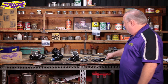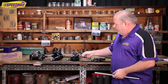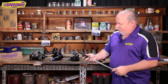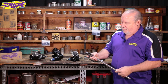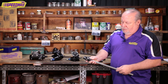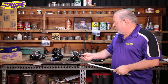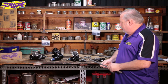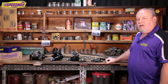What I've actually done on the regular full double D shaft — and I've got this all pre-done up here — I like to use these on my car. I removed the set screw, and once you get it all where you want it, just take a magic marker and mark the spot where the set screw is, then take your drill and just make a little dimple in that. That way the set screw has something to seat down into, and that'll hold it nice and tight.